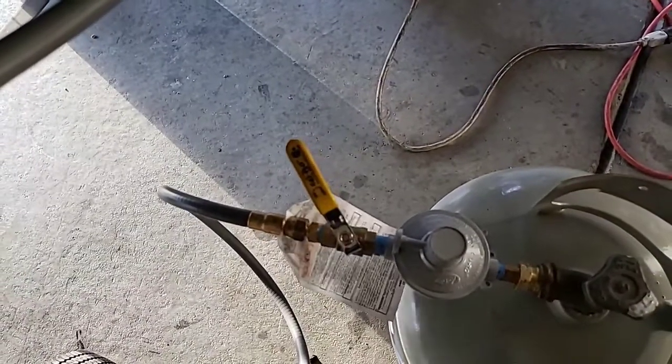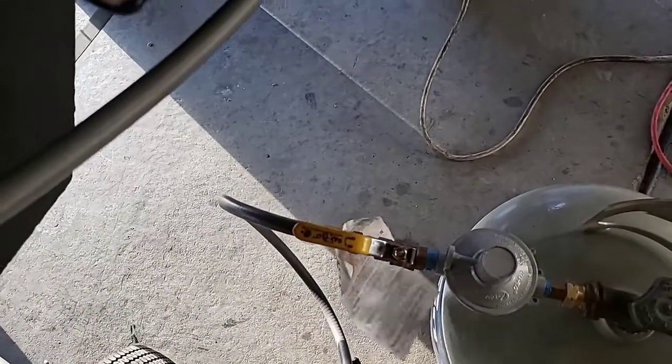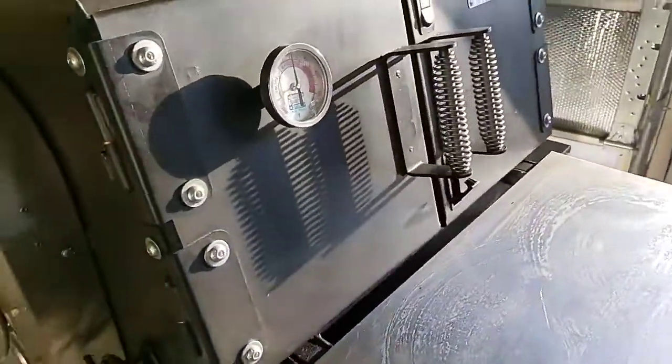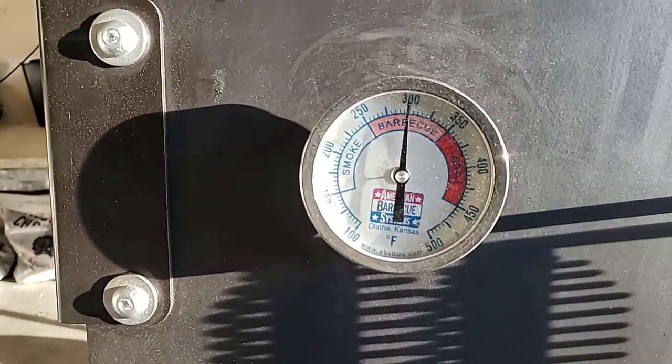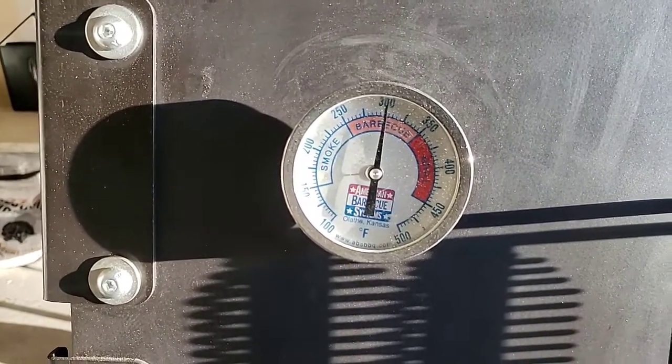This is set at full — you can't keep it at halfway. I've had it like this for two hours and it's been burning consistent. That's the lesson learned. You can see it already went up to 300 degrees, so it will shut off in a few minutes and then go back down to 250. So three reasons the pilot light might shut off: wind, not getting enough oxygen in your pit, and your thermocouple being too close to your burner. God bless.